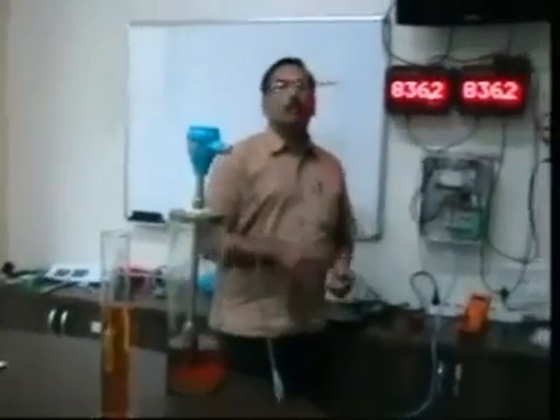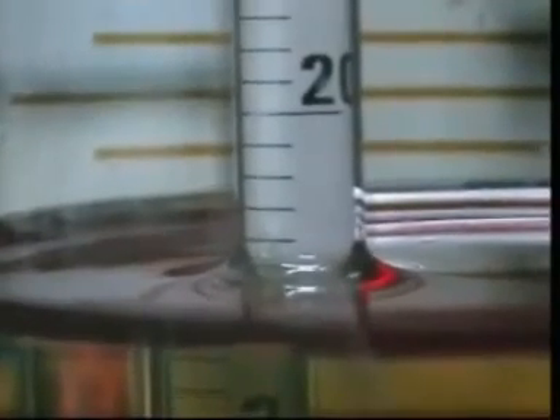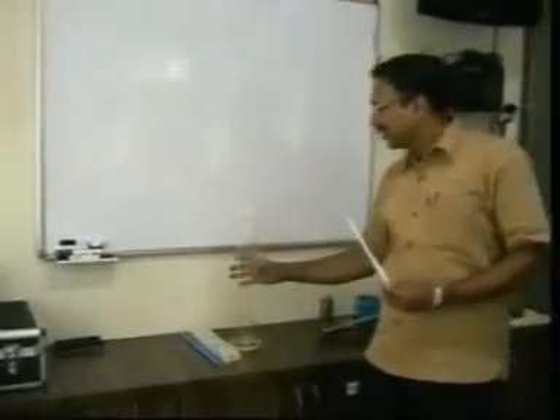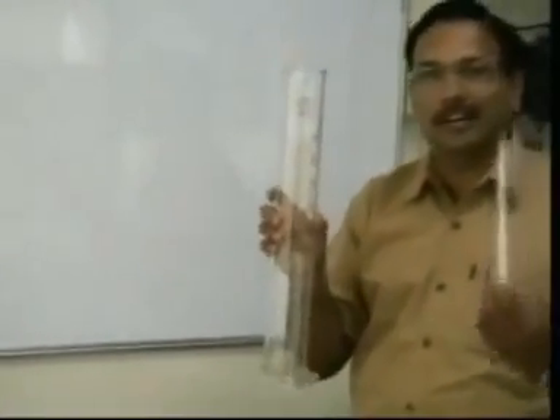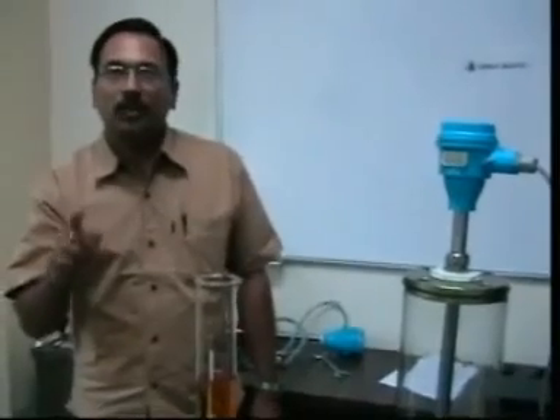Now we will see what steps to take if there is a difference found between the display reading and the manual reading. Take the density manually using a hydrometer and start with an accurate manual reading. The upper touch point is 24 — do not forget to consider the meniscus. This is a false reading; you have to take reading 25, because of the formation of the meniscus. Before taking a sample for manual density measurement, use a clean glass cylinder — do not use plastic or dirty cylinders. The methodology to take correct manual reading is described in ASTM D1298, that is the American Society for Testing Materials.